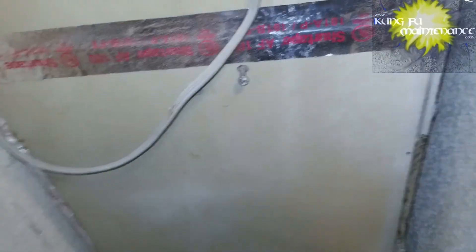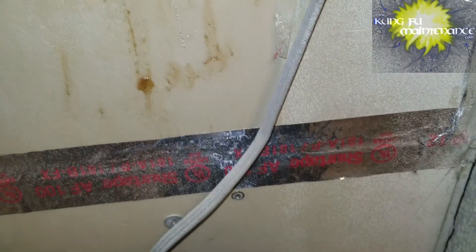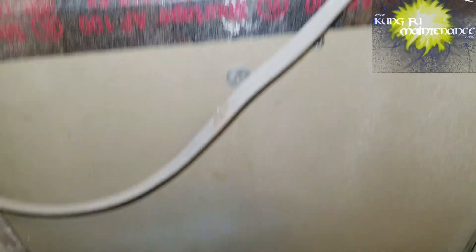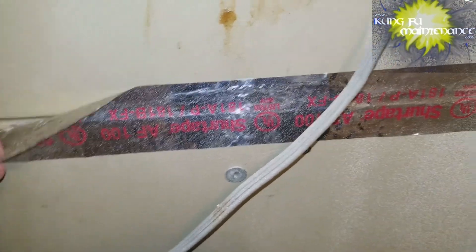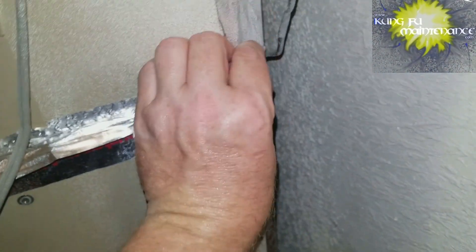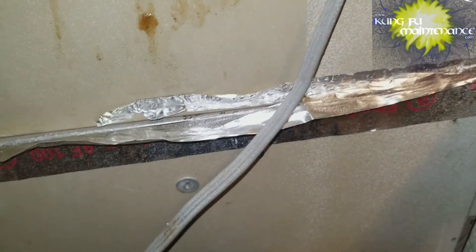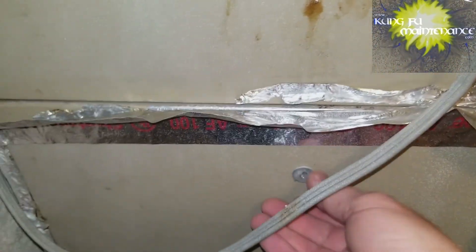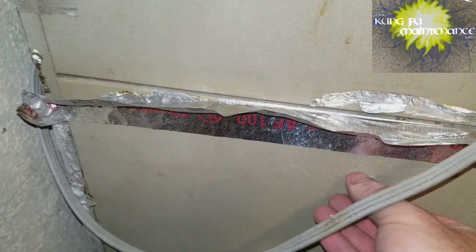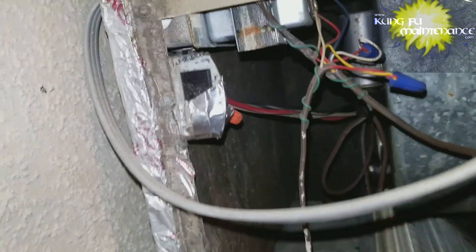Okay, so here it is — checking the leak for this one, the second one. Didn't have any luck on the first one, and this one I may need the dye test on as well. But I charged it and it's getting nice and cold. I'm going to try to find this leak, but I also wanted to show you the difference between the A-frame coil and the slant coil. So this one's a slant coil. Right here is a service door switch that looks like it's been taped shut — most likely bypassed.